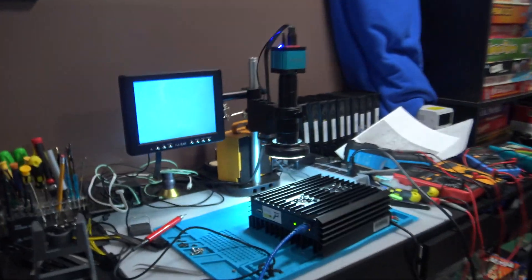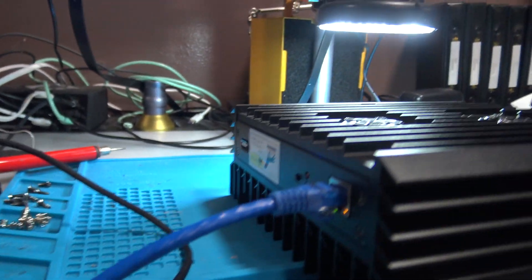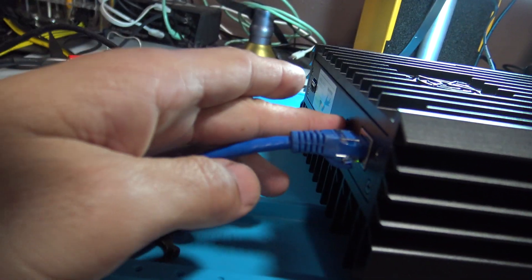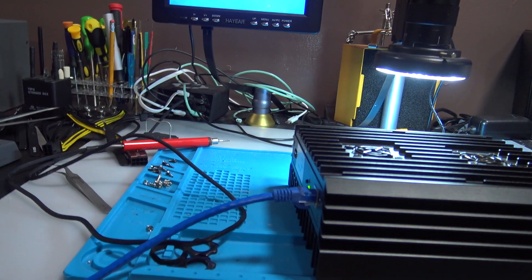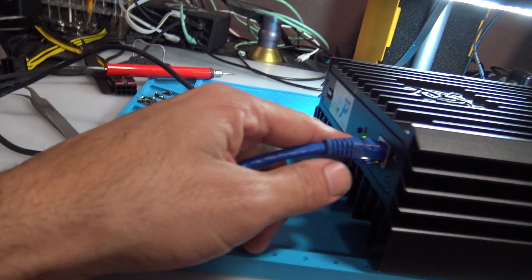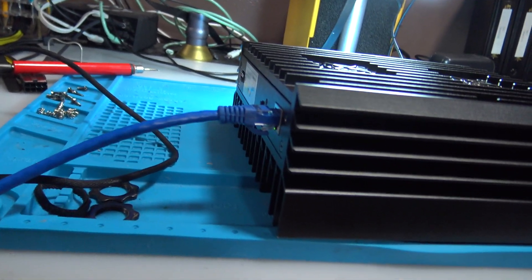I still can't figure out what the blinking pattern means. It has a kind of skipping blink instead of a normal steady blink. The chips aren't getting really hot, and when I looked to see if the chips are firing, I don't see any of them firing. I'm going to open it up and probe around a bit. Everything seems normal - fans turn on, both lights turn on then go off after a minute like they're supposed to. The GUI shows up and says it's connected to the pool, but I don't see anything in the pool and the chips aren't getting hot.